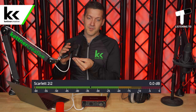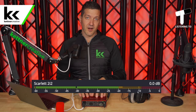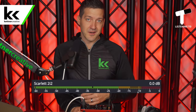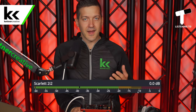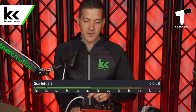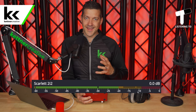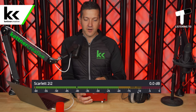I have both switches turned off again and I'm putting the plate back on the back of the microphone. We have one other option to change the sound of this microphone, and that's on the Focusrite Scarlett 2i2 itself. There is a button on the front that says Air. This Air button will add a little bit of harmonic distortion — similar to the frequency boost built into the microphone, it adds enhancement in the upper frequencies for a bit more clarity and intelligibility. This is what the Blue Sona sounds like with the Air mode turned on.